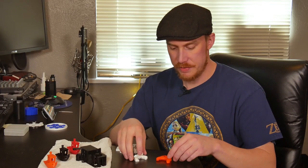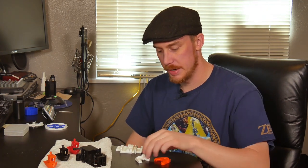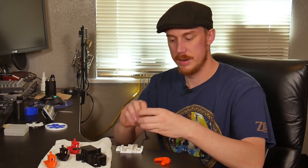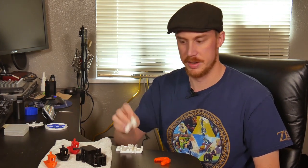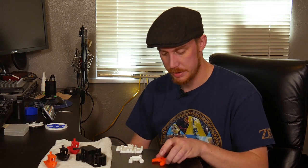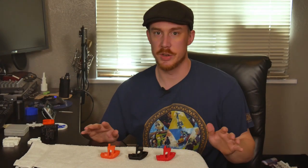Live and learn. Now, as for the cooling shroud, even if I didn't have the original, I would probably be okay because the shroud is printed in ABS. Specifically, it's the only part on the i3 Mark III that they recommend always using ABS on, just because it's down there with the hot end with all the melted plastic. You definitely want to make sure you're using the plastic with the highest thermal tolerance whenever you're in that area. But the good thing about ABS is you don't need a cooling fan to print with it. So had I been completely out of luck on the fan shroud, I still could have just printed myself a new fan shroud without a fan shroud. How cool is that?